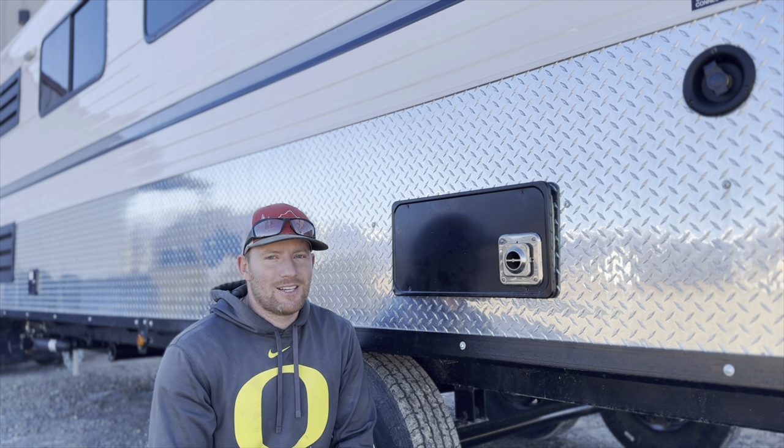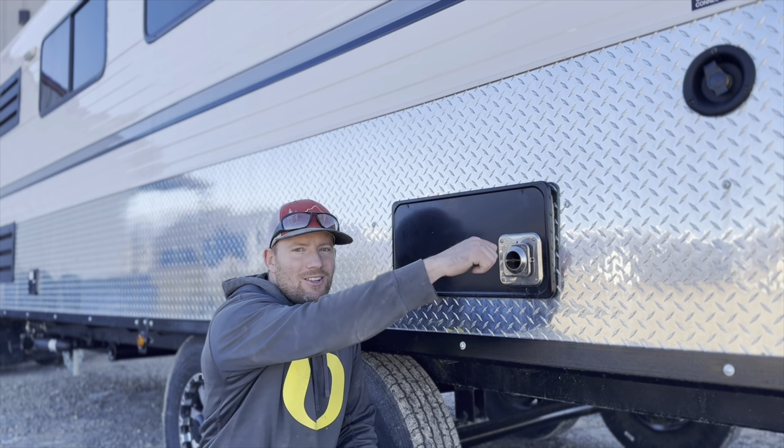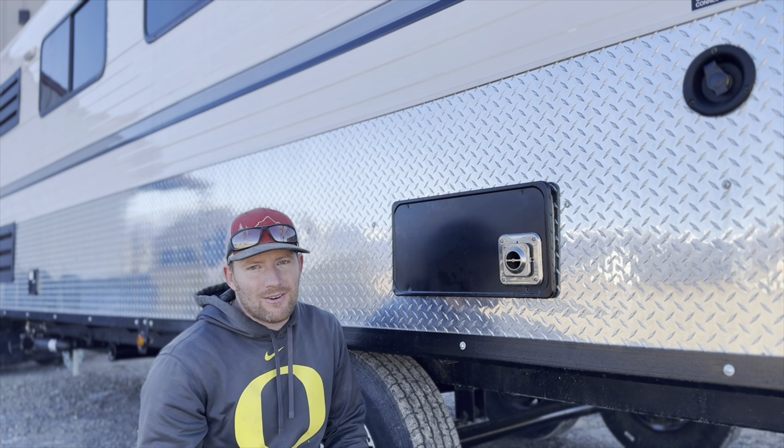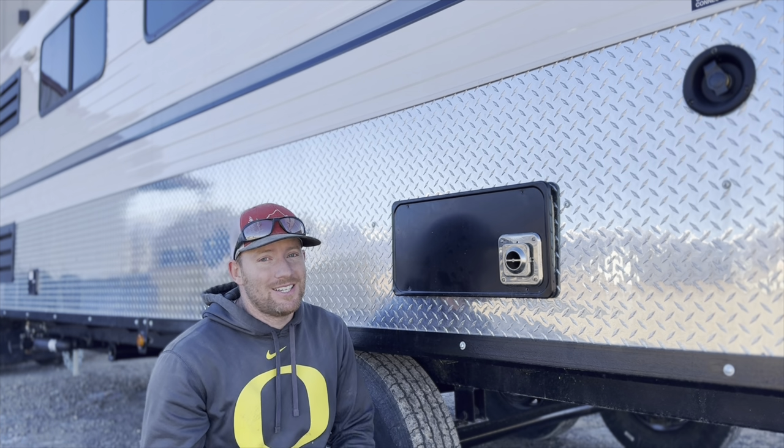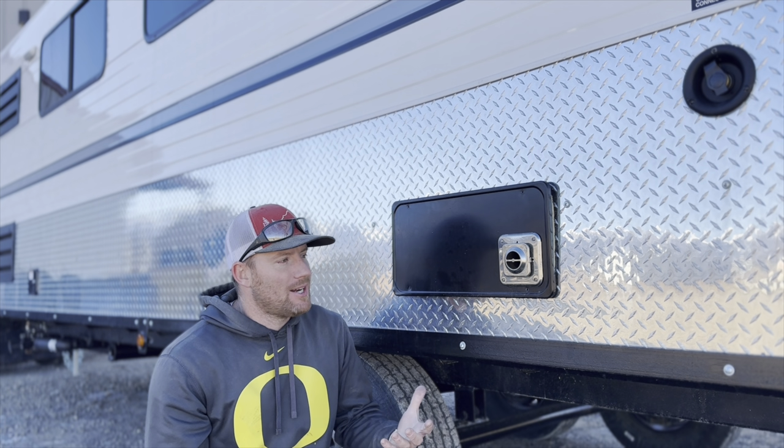If you've got a furnace that doesn't work, don't hesitate to get your air compressor, put your air nozzle on, and blow that exhaust tube out. That's a pretty easy thing to do. If that doesn't work, then you can dive in a little deeper. And that's what we're gonna do today.